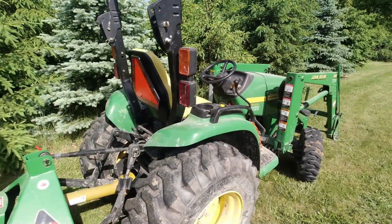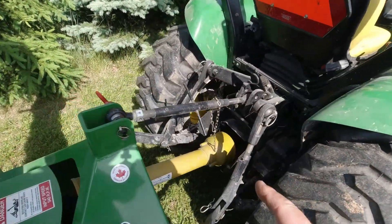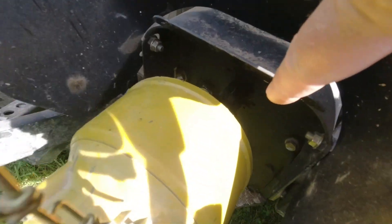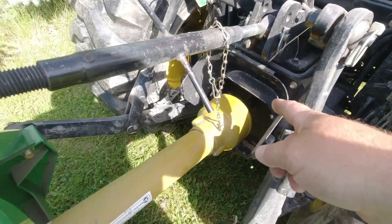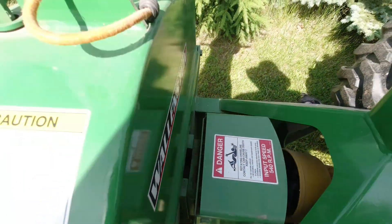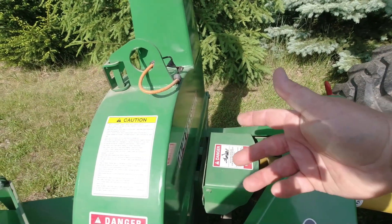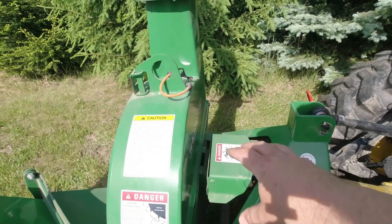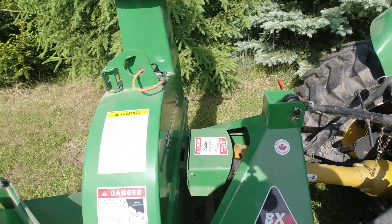For those of you who don't know, tractors have what's called a PTO — power takeoff — and that's this right here. You can see that spline right down in there that spins, and that in turn spins this shaft which then comes to a gearbox normally. So if it's using a mower or something like that, it changes the power from spinning this way to spinning this way on a mower — it would have a gearbox up here to do that. This one I believe is actually just direct drive.